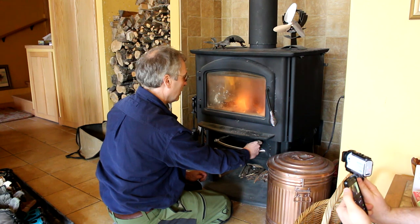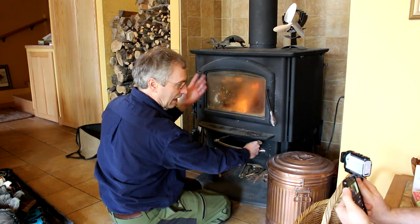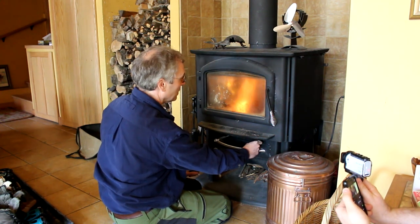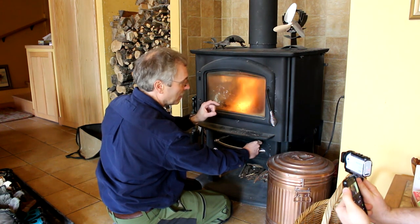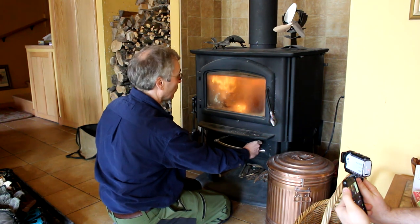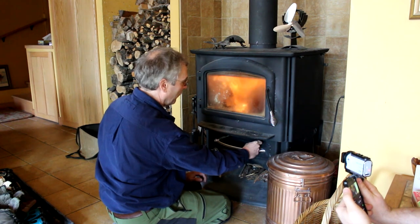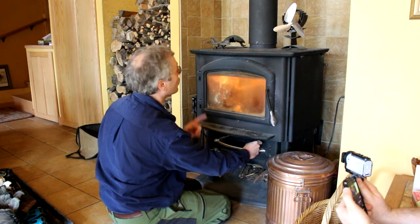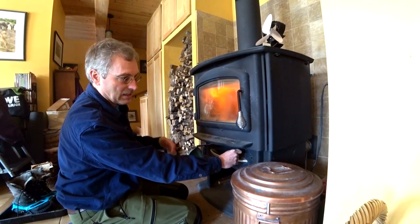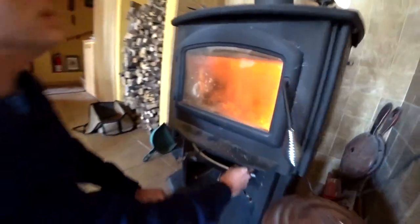I've perfected running the thing smoothly. The vertical pipe when I brush it out will have a little ash, but the horizontal pipe I need help to remove because it's awkward. Because of the higher temperatures, it's not creosote in that pipe, but you do get more ash in the horizontal run. What I'm doing right now is holding the ash door flap open, which helps get the fire up to temperature quicker. The quicker you get the fire up to temperature, the less creosote you'll have.